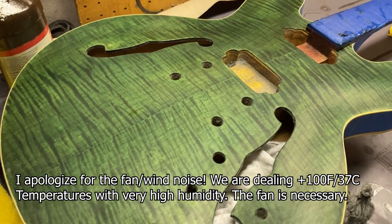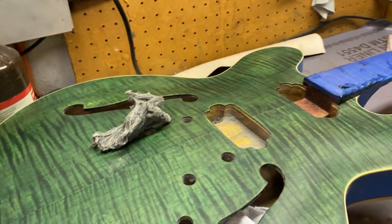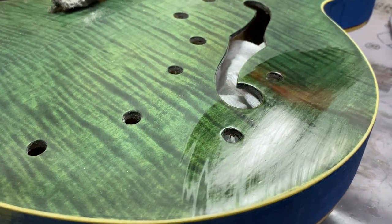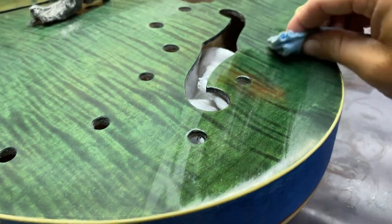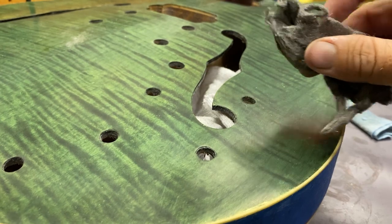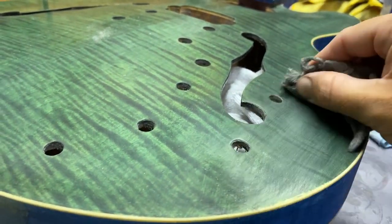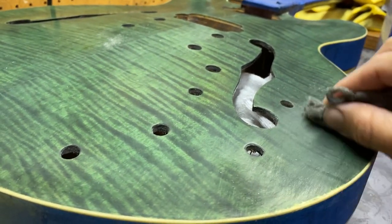I am currently working on steel wooling a layer down, because if I take this wet rag and go over it right here, we're going to see some — well, not so much right there because I've already worked on it. Let's find a spot. Yeah, see all these little dimples here? We want them gone. Those are dust specks. This is 4-aught steel wool — four zeros. You're just going to gently go back and forth. I like to go in the direction that I put the stain on, but every once in a while I'll go a little bit sideways to give it a little more cut.